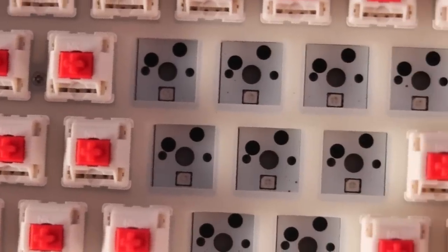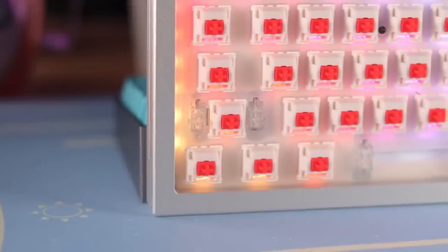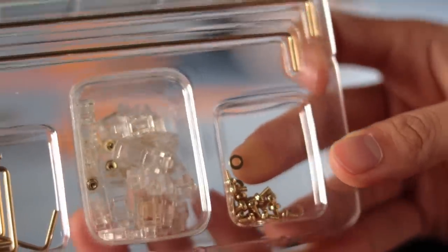In dim lighting it is hard to see these keycaps. Looking inside, there are five-pin hot-swappable sockets and they are south-facing, so no need to worry about Cherry profile keycaps interfering. You can use pretty much any mechanical switch and any keycap profile. There are GOAT stabilizers — Glorious's proprietary stabs — which resemble Durock or Everglide stabilizers but with all-clear housings and PCB screw-in mounting. I relubed all the stabilizers, but that spacebar needs a lot of additional lube.